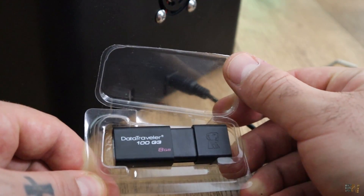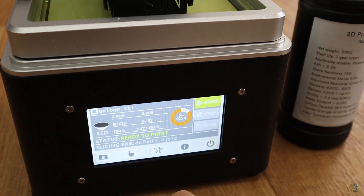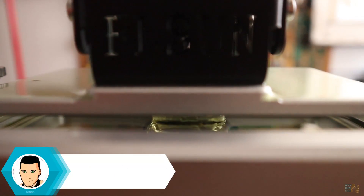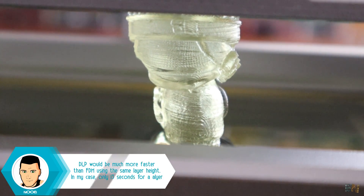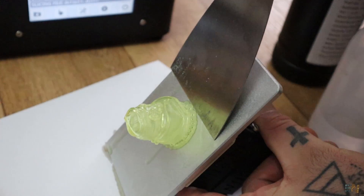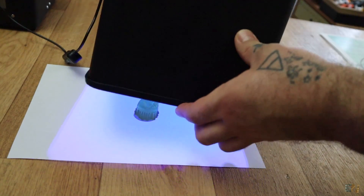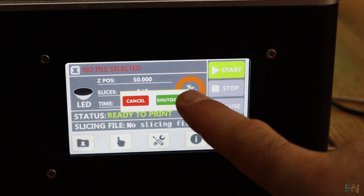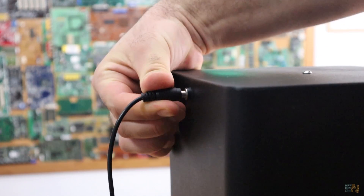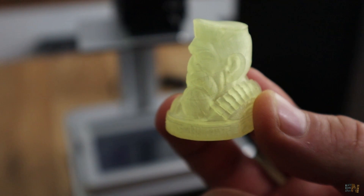Insert the SD card which has some examples on it. Go to the menu, open the SD card, and select the MMS files. I first selected the zombie hunting model, pressed Start, and there you go. The printing process takes a few hours — not because the printer is slower than FDM printers, but because the layer height is around 0.05mm, which is amazing, but means many more layers to print. The printed part came out great — the details are amazing. When printing is finished, clean the remaining liquid resin with alcohol, then place the part under UV light or in direct sun for a few minutes. For this small part, 20 minutes under UV light was more than enough.